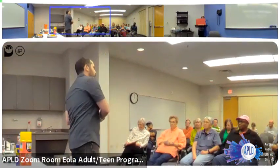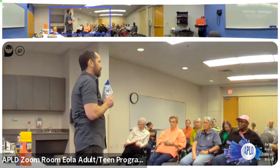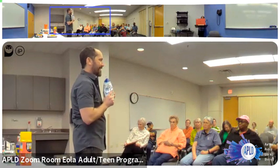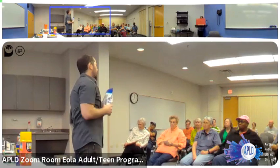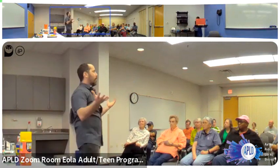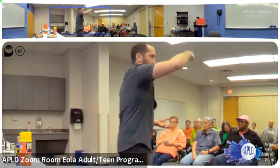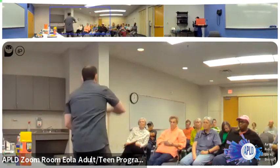Okay, that number is the anticipated working time of the product. So I mix it up. I should have about 5 minutes before it starts to harden up. And then I can recoat in 5 minutes. Okay, you can buy this stuff in a bunch of numbers, anywhere from 5 to 90. I think they maybe even make a 120. But the point is, I can get those three coats on in an hour, right? Mix up a bucket. Wait, come back, mix up another bucket.